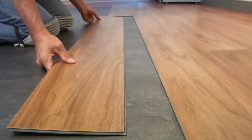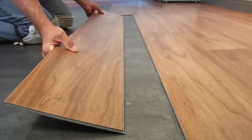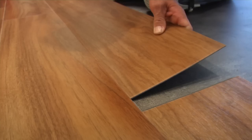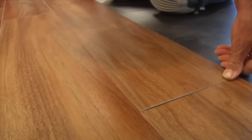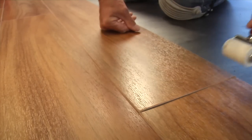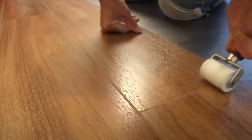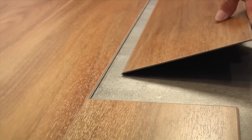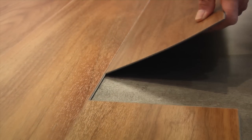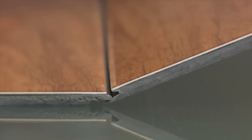To click the length joint of the plank or tile together, lift slightly to engage the lock, shifting it to properly match the end joint against the previous plank or tile. Rotate downward, clicking together for a tight fit. Use a small hand roller or seam roller to press and lock the compression fit end joint. Lock groove to tongue or tongue to groove for this application. For tile, use the same technique.